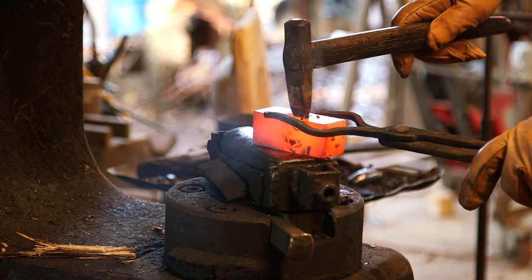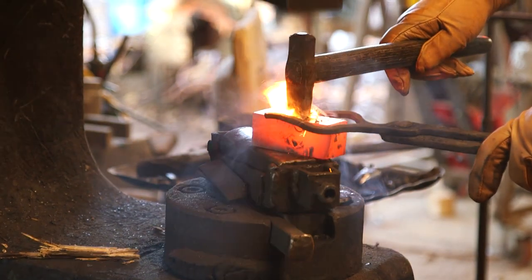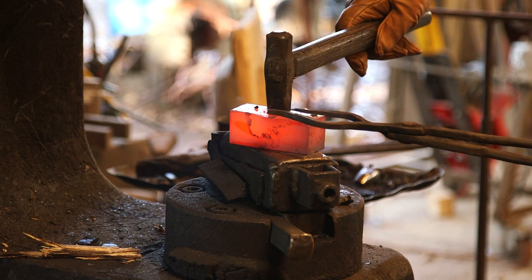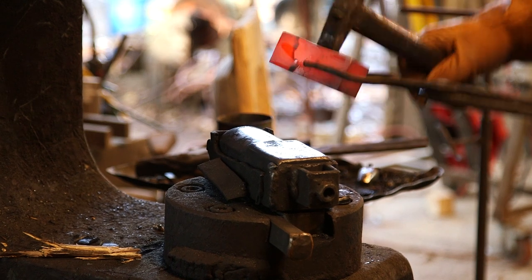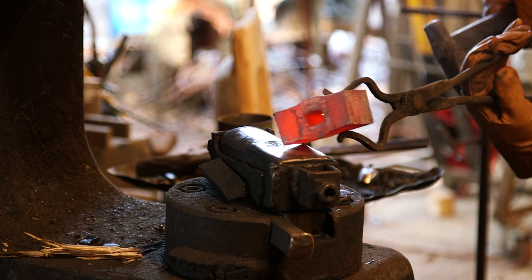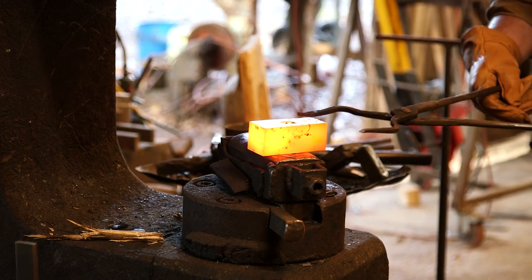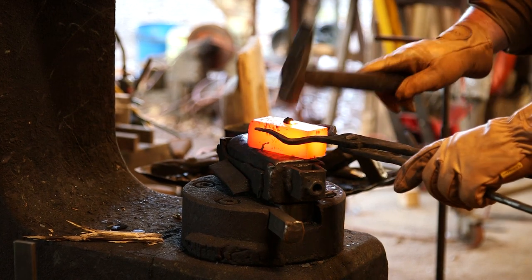What you're seeing me do is: once I get started, I take a little piece of coal, pop it down in there, and that coal acts as a lubricant — it helps me get that piece out. When I pulled that slitter out, there was like a perfect form of coal and it looked like the front end of my slitter had actually broken off — my butt puckered a little bit right there! But there's one side slit. I'll go back into the fire and go in from the other side. This one turned out really super well.